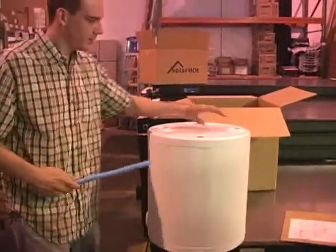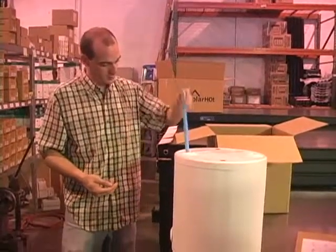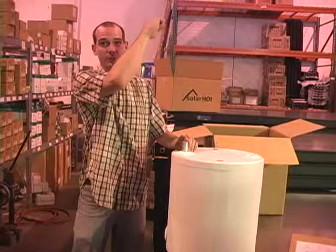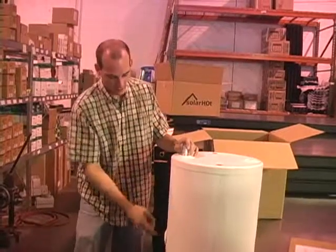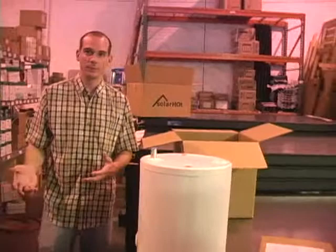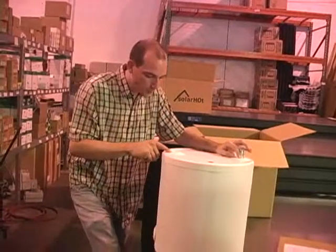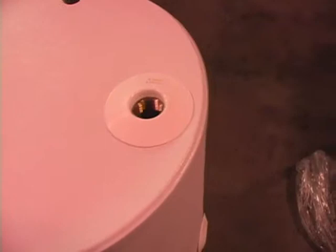The main thing I want to show is these two ports. If you drop your dip tube into the wrong port, the returning air being pushed out of your collectors in a drain-back system is going to shoot down that dip tube and pull it straight back out — you end up recirculating air through your system, which can bind up in your pump and cause the system to stop working entirely. You want to make sure the dip tube goes in the correct port. They are actually labeled, but the labeling is light in color and if you're working in a crawl space you might not see it.